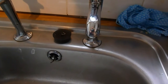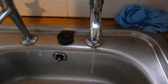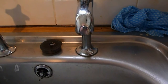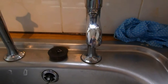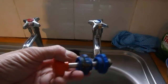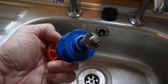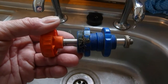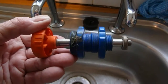If you're in a hard water area like London and around Kent, it's probably not just the washer that's gone. You can renew the washer and it will still drip, because a lot of times it is the seating of the tap that needs grinding. For that you need a special reseating tool — thankfully not that expensive, about eight pounds, and something you can use forever.